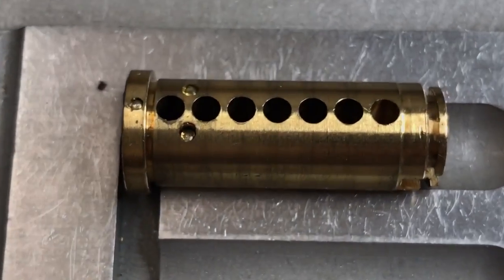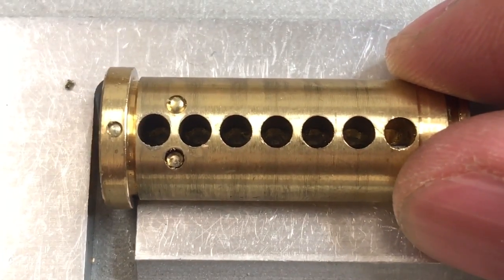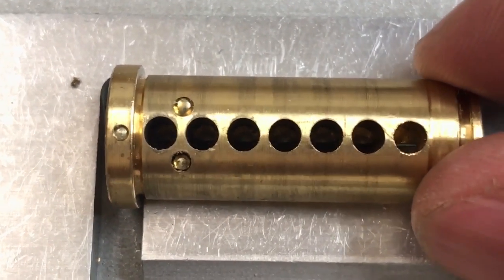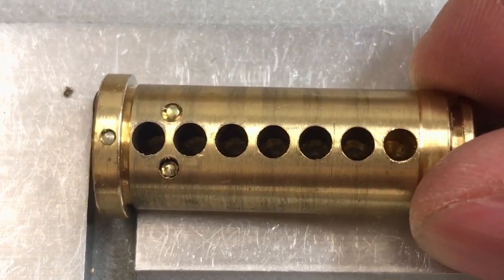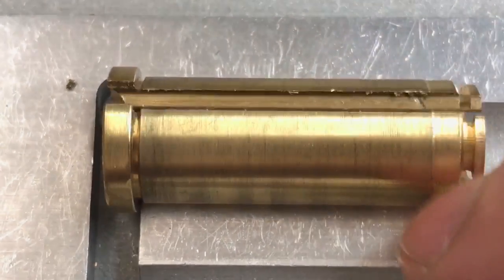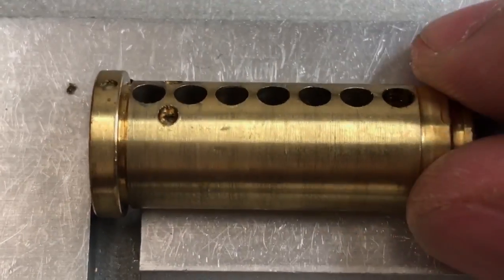Moving over to the core, we can see we have some drill protection up front, right in front of the keyway, and then on either side we have hardened inserts. You can see this is a 7-pin lock, but we only had 6 pins or 6 chambers pinned up. And other than that, it appears to be a relatively normal core.